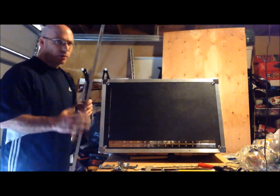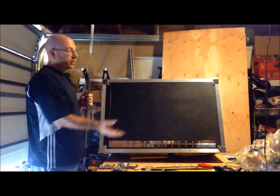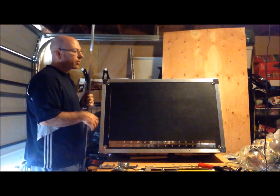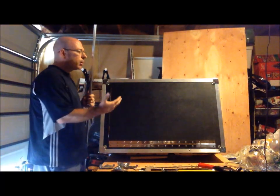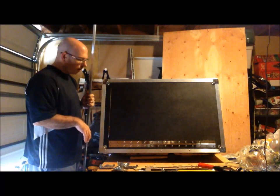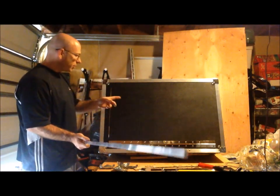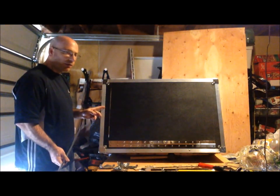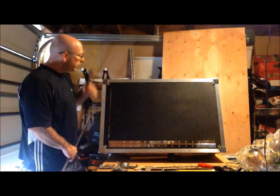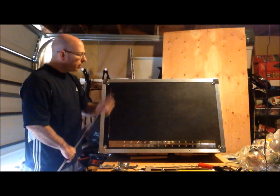How large your door is going to be represents the type of materials you're going to put in. The top door does not need to be as big as the bottom door. You're putting in a lot less material, or materials of larger size. However, I'm going to make a uniform top and bottom. This here is going to go around all your edges, on the door and in the frame all the way around. I'll be cutting the corners to an angle so they can meet. I'll be riveting them in. The latches will go on.